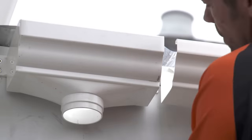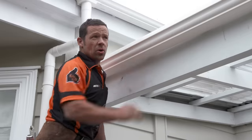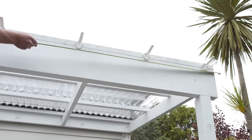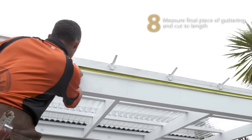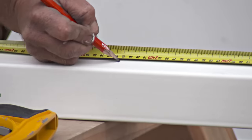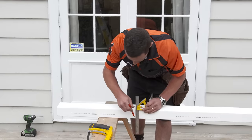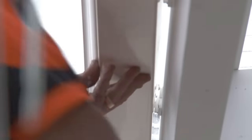This dropper or expansion outlet adjusts for thermal movement depending on the temperature at the time of installation, which in this case is about 20 degrees. All I need to do now is measure from my end of my beam up to our joiner — I want to measure to the center of my bracket, and I got 2440. I'll square that across, clean the dags off the end, then take this up into position and glue in our jointer and slip this piece in.